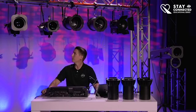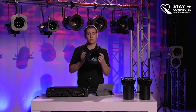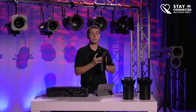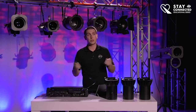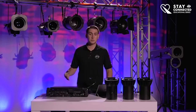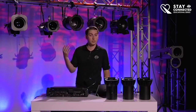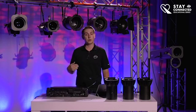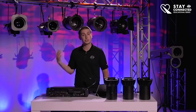So let's talk about the body of the unit itself. This is a lens tube — it says 26 on the side, so this is a 26-degree lens tube, and these will basically change the degree throw distance. For example, I actually have an Encore Profile Pro Color up in front of me for my front light, and that's really nice because I can change the dynamic white scale depending on who's presenting. One of our other sales guys, Edgar Bernal, has a very different skin tone than I do, so he needs a completely different Kelvin temperature. It's really easy to go into your console and change it right from the console, as opposed to having to put a gel in.